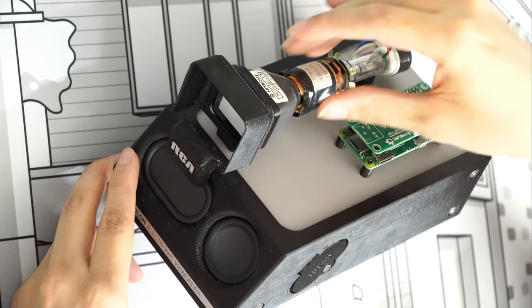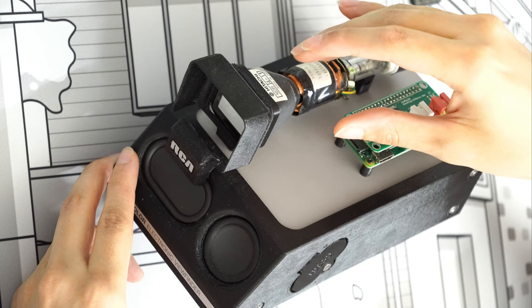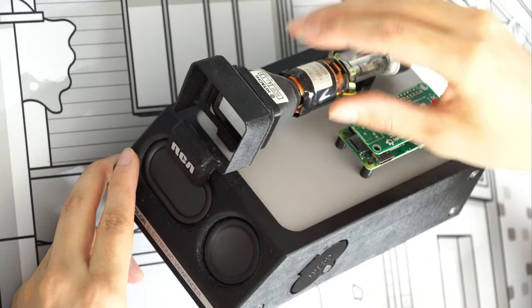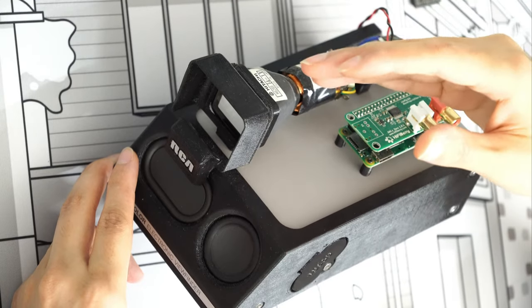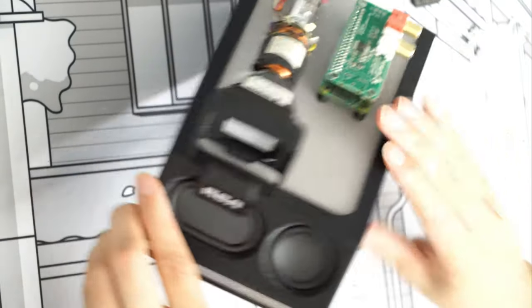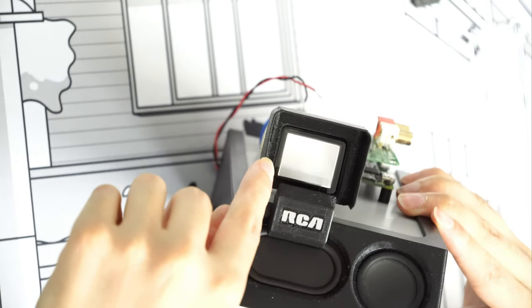The tube here is not actually black and white. This is an Indextron type of tube. It's a Beam Index, sorry, I was looking for the name. Indextron is the Sony brand name for the technology. But it's a Beam Index CRT. So this tube looks like a standard black and white tube, but it's got stripes of colors on screen.